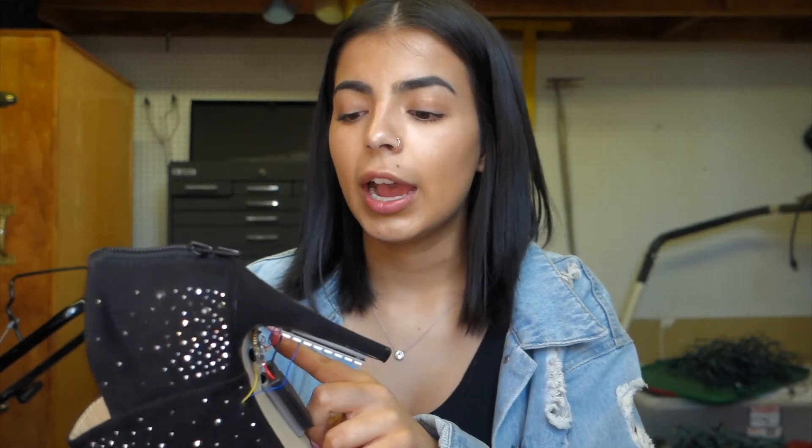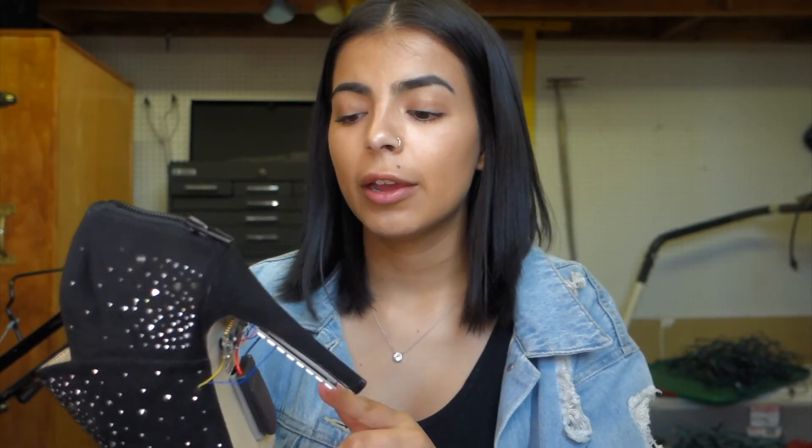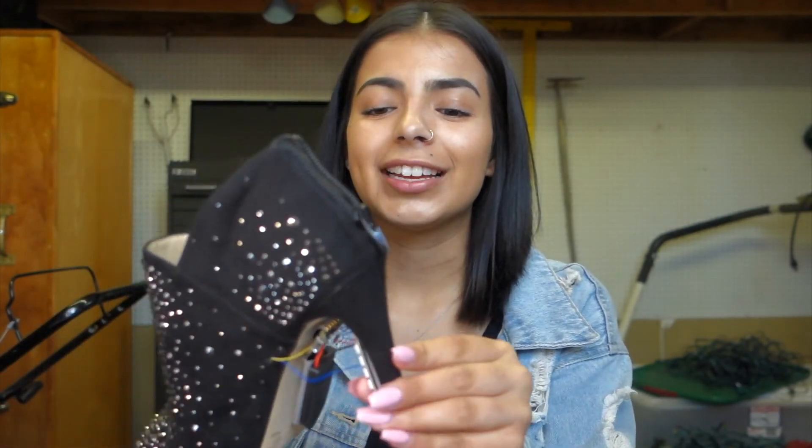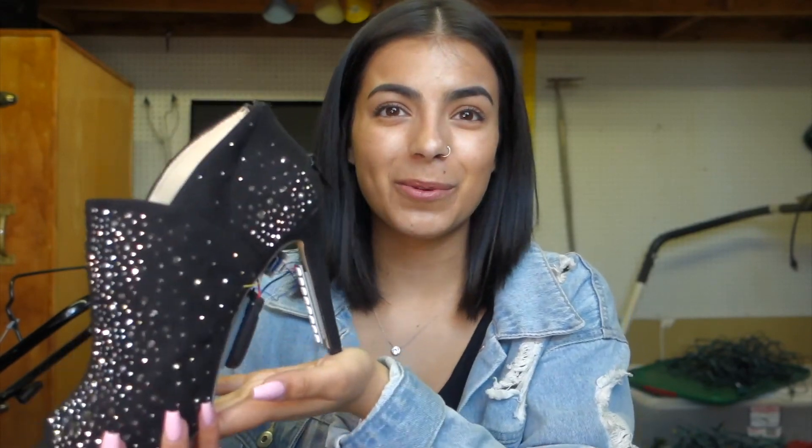This was a really fun project — I think these are so cute. One thing I will say is I think I got a different board than Beauty and the Bolt did, and my board requires more voltage. With the batteries I'm using, it shorts out after about one or two minutes of being on. I've used this Arduino board before but with a 5-volt battery pack, and this one is only giving off 3 volts. So if I do this again or actually wear these out, I would buy a 5-volt battery pack small enough to fit on the back. But it's just a fun project to say I've accomplished. If you haven't already, check out my video where I did sewable LED lights on a shirt and the jacket I made last year. Thank you so much for watching — see you in the next video, bye!